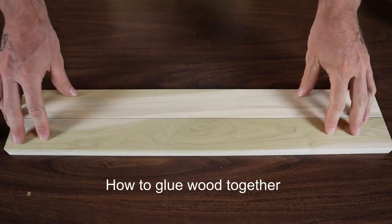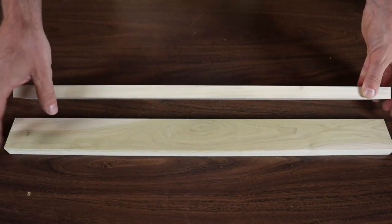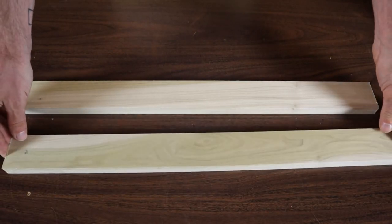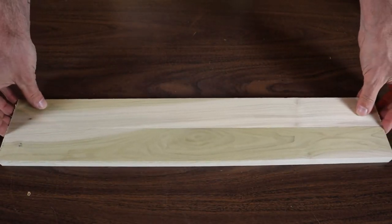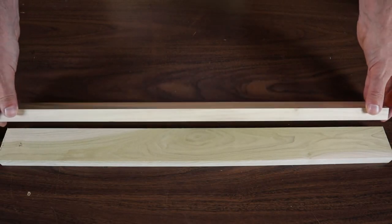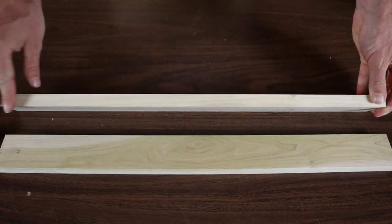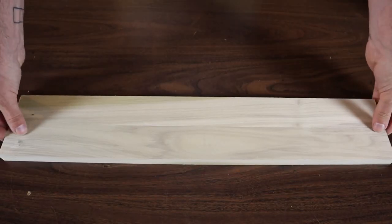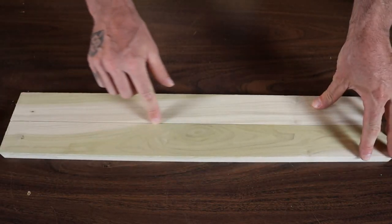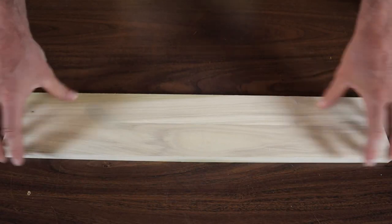The first and probably most important thing about gluing boards edge to edge is to have the edge perfectly flat and square — 90 degrees to the face. For shorter boards you could get away with a table saw or buying flat stock, but for longer boards you'll probably want a jointer. For small DIY like this you can just run it through a rip saw or buy straight flat stock. Also think about composing your board — matching the grain so when you stain it looks like one continuous grain.